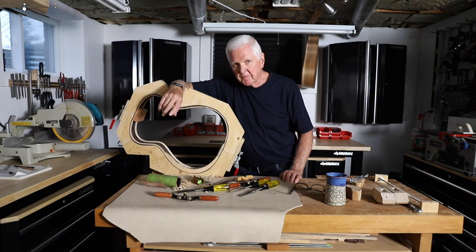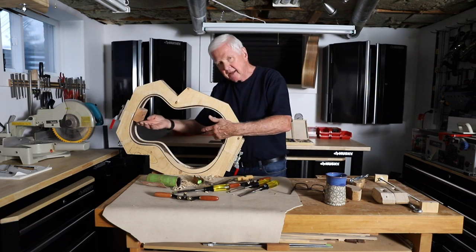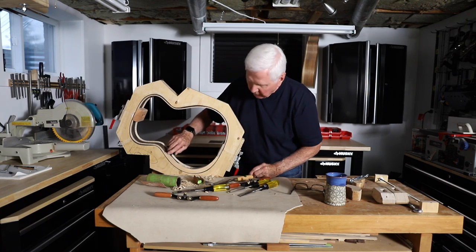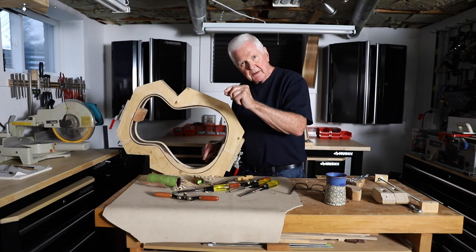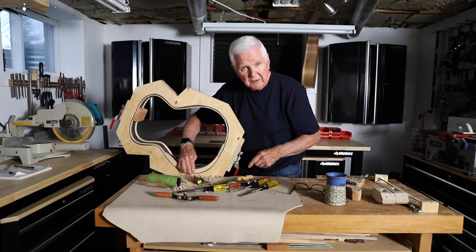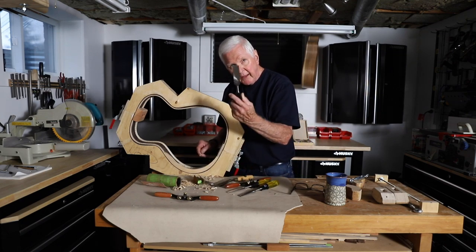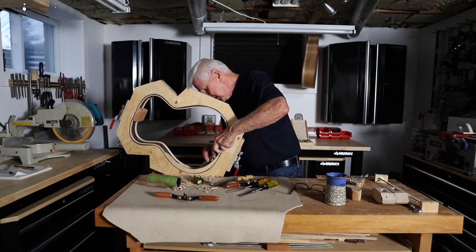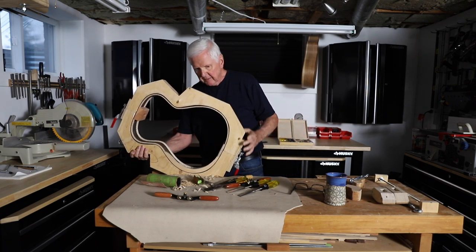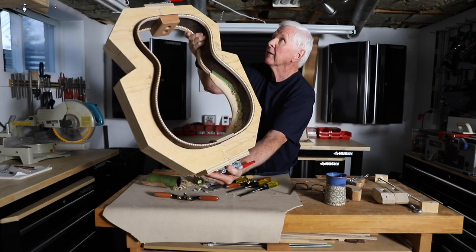I'm Monty McKinnon, and today we're going to examine the armrests we've been working on. I've taken the bracing out so I can get in and start to cut this back. What I did was take a pencil and draw a line around here, leaving approximately three-quarters of an inch to an inch of wood. The next challenge was to take the chisel — I started with a one-inch chisel — and carved down here to make it sit on a bit of a slant, as you can see right here.